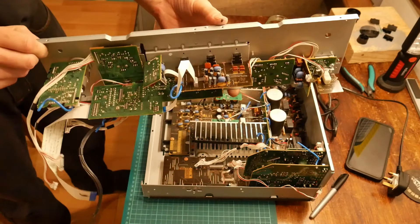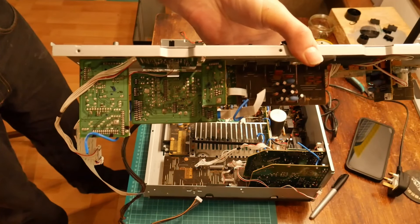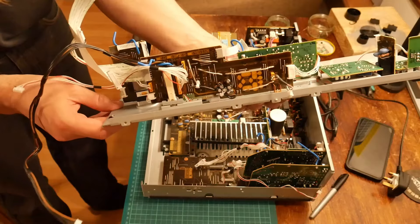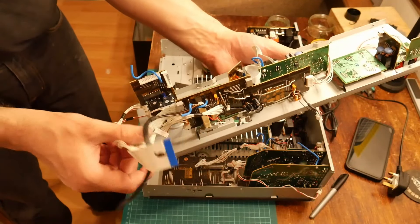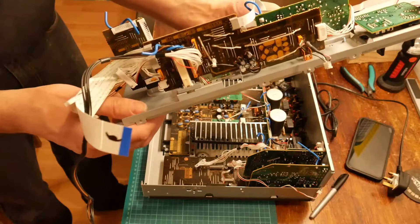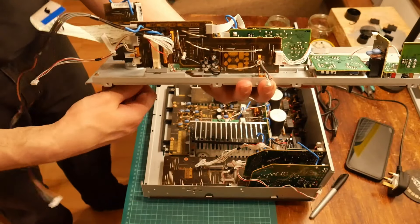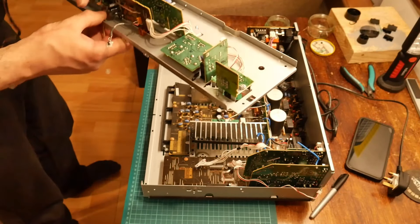When you look at the back sides of those boards, you'd think they've probably got a ton of electronics on them because of the amount of tracks. But when you look underneath them, there's nothing — no active components whatsoever. It's all just signal routing. There's something here — I'm guessing that's either an inline op-amp, or some voltage-to-volume converter, or a motor driver, because it's actually a motor-driven pot, old school style. I don't have the service manual — I'll download one at some point.